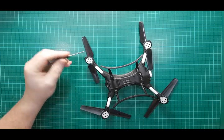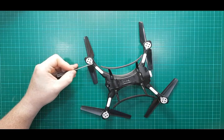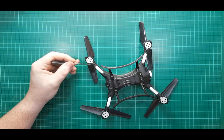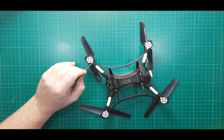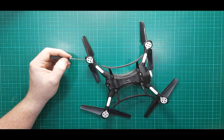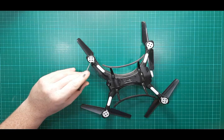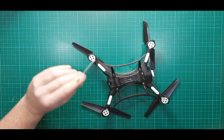This is a little brushed quadcopter, so there are no ESCs. The motors are stepped down through a cog. One thing I like about this over some of the other cheap ones — quite a lot of them use a metal cog on the motor with a plastic larger gear, and the stronger metal gear strips the plastic. I find plastic-to-plastic or nylon-to-nylon gears hold up better. I've run these motors for about 20 minutes of flight time and there's no sign of wear or damage.